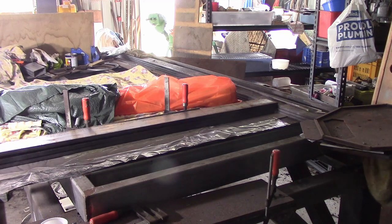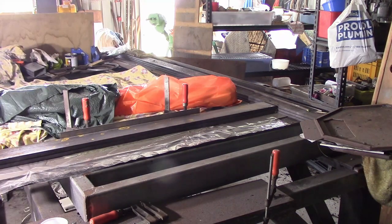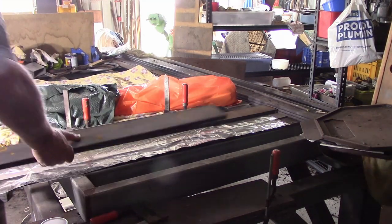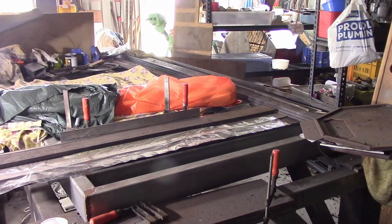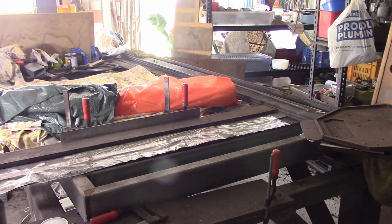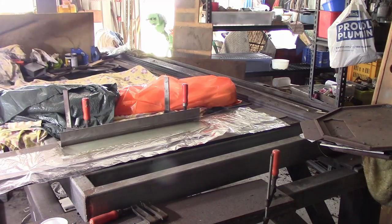And since I don't have an autoclave or any sort of pressure-forming mould, what I did to make what will become the top surface of the fairing is to lay it up on some perspex, which I'd coated with release agent, and then stack some really heavy metal bars on top of it to squeeze out any excess resin. I used about 10 or 14 layers of 8-ounce satin weave S-glass, which is way overkill for the job, but it was what I had on hand and didn't cost me anything.